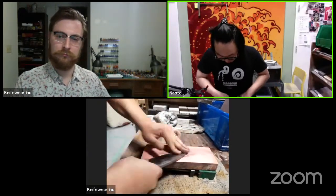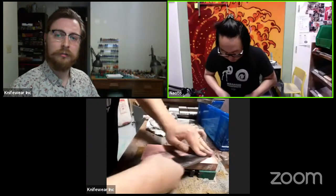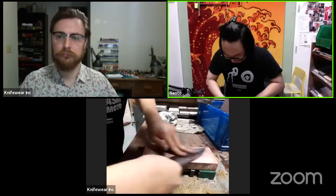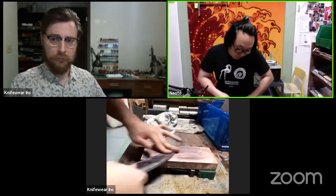Just move to the Kencho K6000. See what finish this gives. And are you doing this to polish the edge, or just to give the bevel a nice finish? It's a little bit like makeup. It's to make it look pretty. The last edge is really to put a micro bevel, which I will give about this angle. I may give a little bit more, but like this. This is really to give the knife a pretty look.